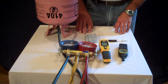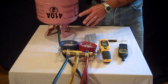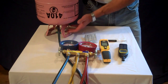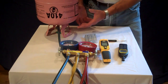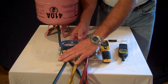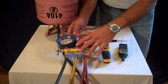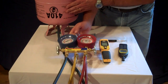The second method for calibrating your gauge is using a tank of refrigerant and hooking that up to your manifold set. I've already hooked up my hose and opened the valve. I'm turning the tank upside down so that I'm getting the pressure of the liquid inside the tank and not the vapor. I've also bled my line out, removed all the air from the line, and now my gauge is reading the proper pressure in the tank.